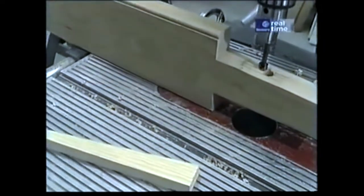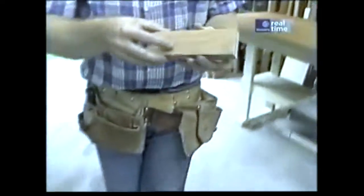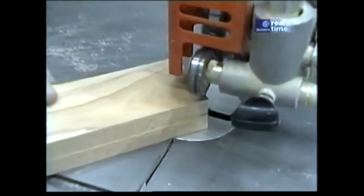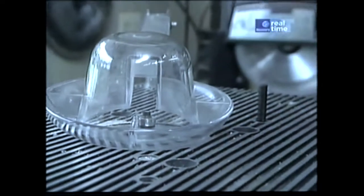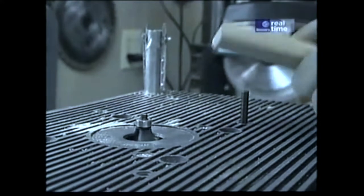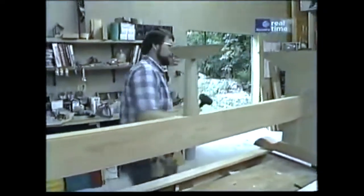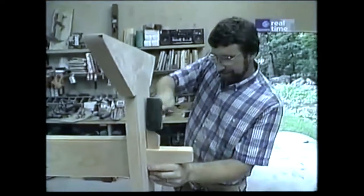The rest of the mortising will take place at just 90 degrees. That cleans up the mortises, and now I'm ready to make the wedges, which are half-inch stock — I'll just hold a couple pieces together and cut them on the bandsaw. That does a nice job rounding off the edges using a quarter-inch rounding over bit in my router table. Now I'll bring this over to the trestle assembly to see if it fits — that's pretty good. The centerpiece is all fit, and now just to tighten down this wedge. Now I'm ready for the top.